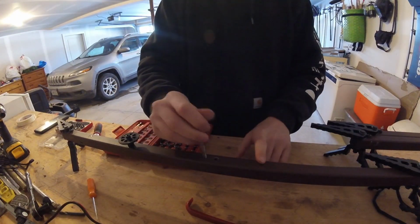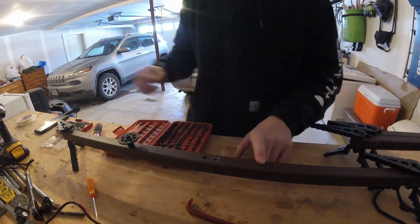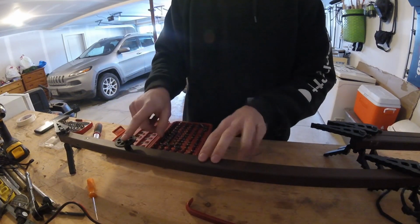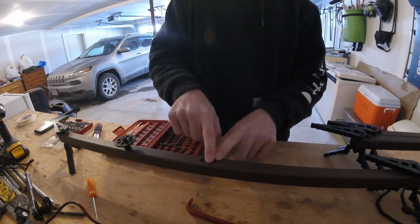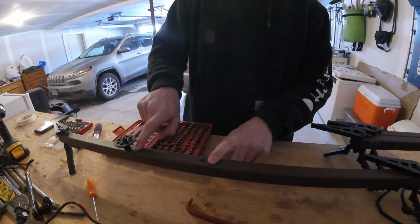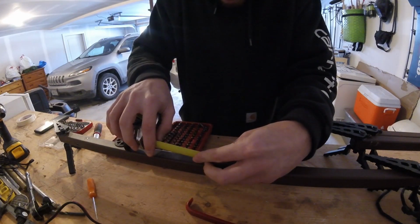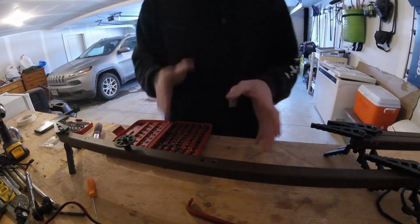Alright, so your bores here are 1/4", nice and tight, and it looks like those are consistent all the way through. So when I do my relocating of the brackets, I will be relocating a Versa button down here, and then just about where the Versa button is, I'll bore another hole right below it at the same gap here, which we'll take that measurement right now. It's roughly 3/4 inch. I'll put a scale on it and see exactly what it measures.